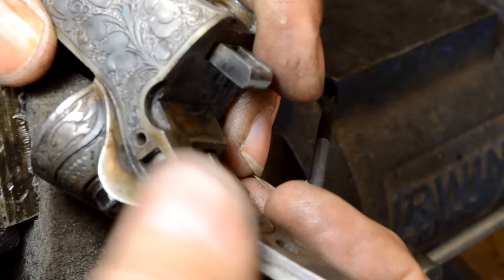I came in and tapped this firing pin out backwards — let's check out the angle that firing pin takes. When I was down inside here I noticed there's a lot of dried-on, almost like varnish stuff. The lock — the part that holds the barrel shut — has a lot of this almost like dried-on gasoline. I got a piece of blue towel and you can see how the end of this spring is open right here — it wasn't closed up, it was just clipped. I think this is a replacement spring and this open end wedged the firing pin.